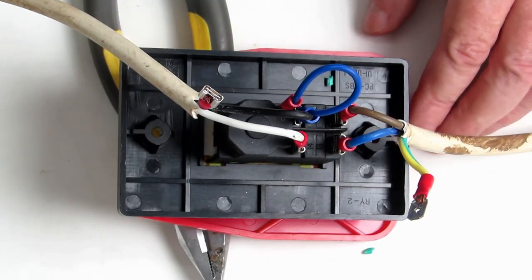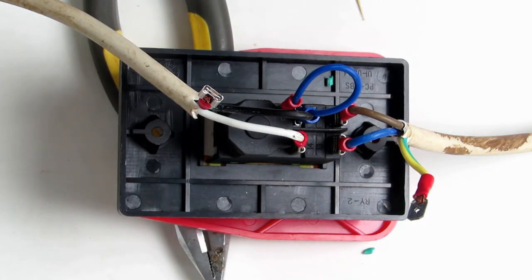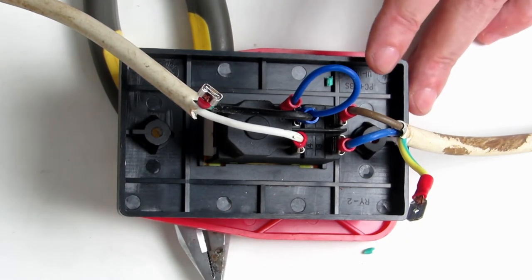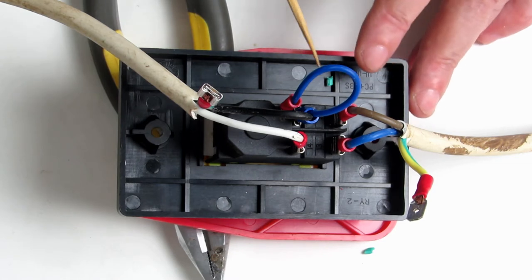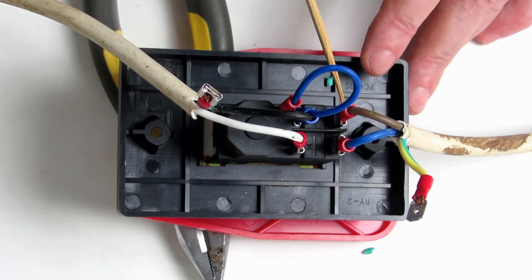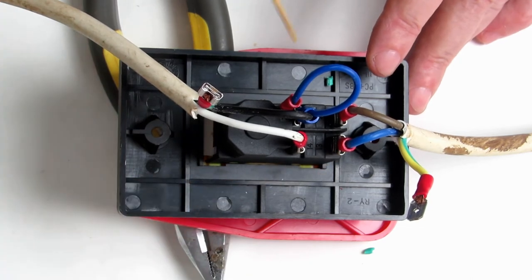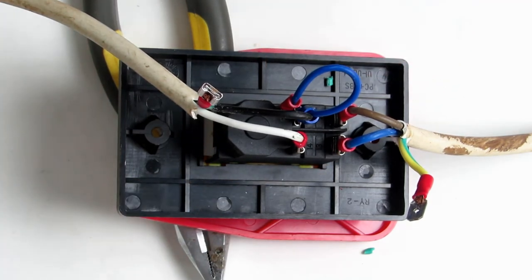To make this simple, I have it tilted up here so I can get a little bit of light on it. Here is our line in — these two wires here. I've disconnected the ground so you'll be able to see better. The brown is the positive and the blue is the neutral. The line in numbers are uneven numbers usually, so this would be number 23 and this would be number 13.